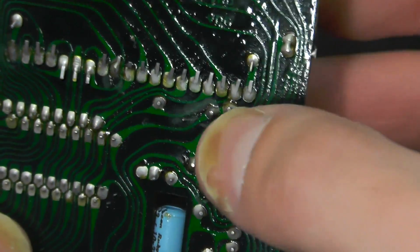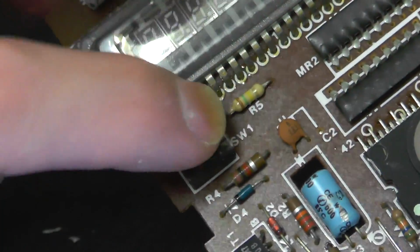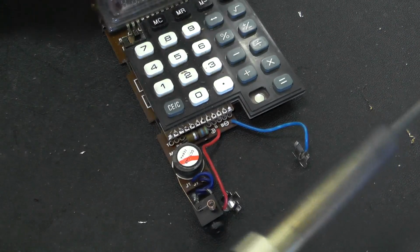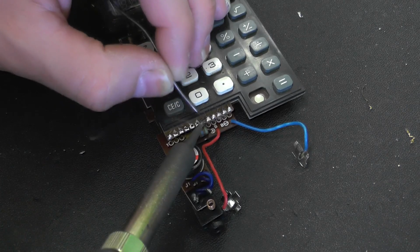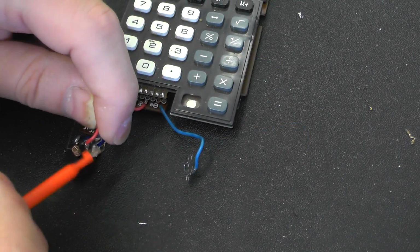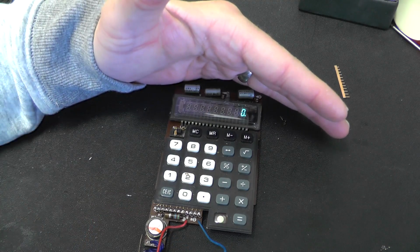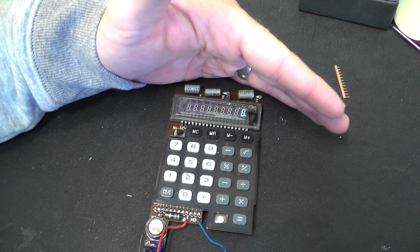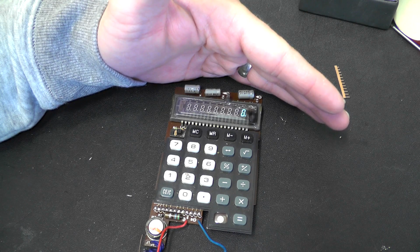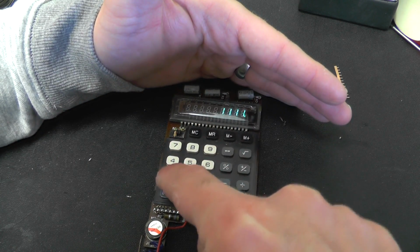Yeah. Power switch is pretty much falling out. I'll resolder that up. That probably works a bit better now. Okay, that's better. So I've got that set to 3.6 volts. I actually set it to 75 milliamps, and it's actually drawing 67 milliamps now. So it looks pretty good. Oh, a bit of a dodgy keyboard there.